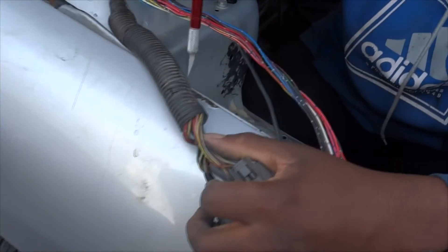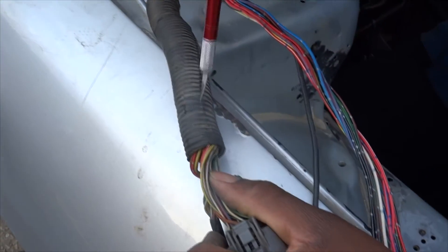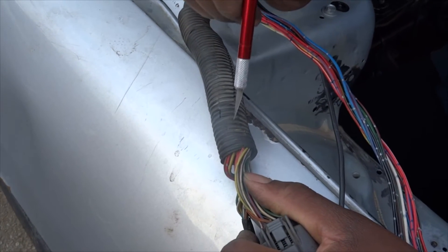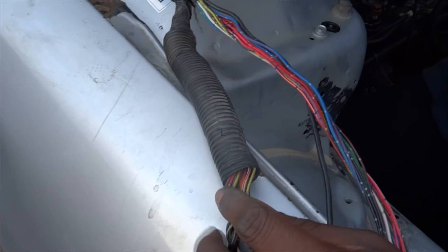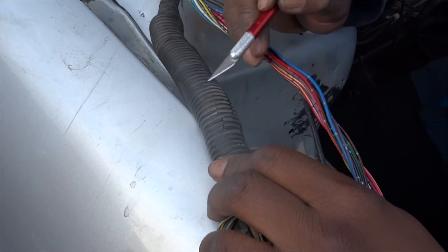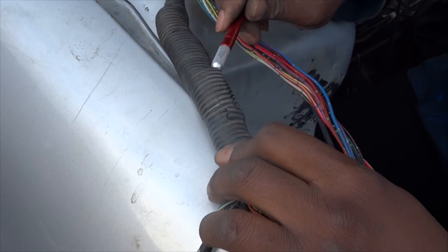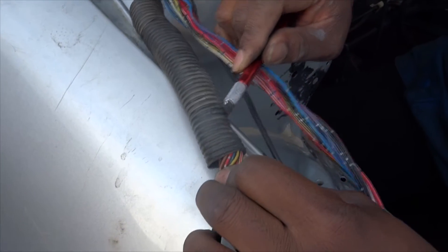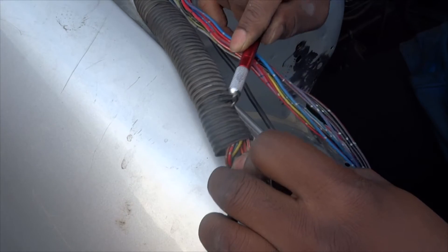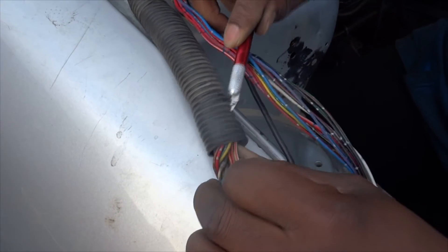When you're doing these insulators and cutting, try not to cut in a downward angle because you could slit the side of a wire, and these things are really sharp. So if you're going to do this, you want to go in from a side angle and cut from the side, trying to have the knife pointing upwards.